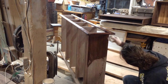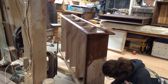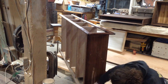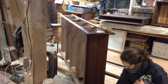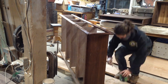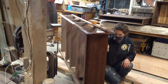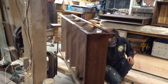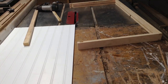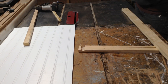Armor Seal satin is going on here. I really like this finish - I've been using Waterlox a lot lately for tabletop surfaces, but I love Armor Seal. It's very easy to apply. I put on about four coats on the surfaces you see the most. I started by doing this on the ground because the piece is tall enough in my shop to brush the ceiling. The only downside was getting it shipped this time of year - the gallon is about 50 bucks, but I had to go to Woodcraft and they only had quarts, so two quarts ended up being about 50 bucks.